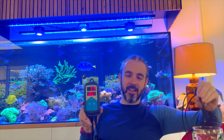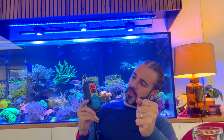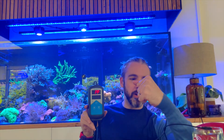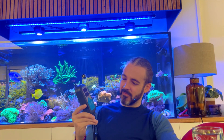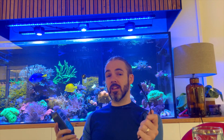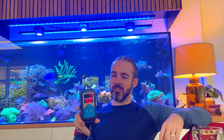You can see it counting down, it's quite responsive — three, two, one — the lamp is now turned back on. Now what happens if I just heat up one of these temperature probes? I'm going to squeeze one of them and attempt to cause the device to enter an error state, with one probe cold and the other quite warm. So I've got one of them in the glass of water and one in my hand. There we go — the alarm is going off and it's now in an error state. I've just silenced that alarm. That would be indicative of a situation where one probe failed or something went drastically wrong with the tank. I've reset this by unplugging and plugging back in with both probes back in the water at the same temperature. It's annoying by design — you want to know when something like that is wrong.